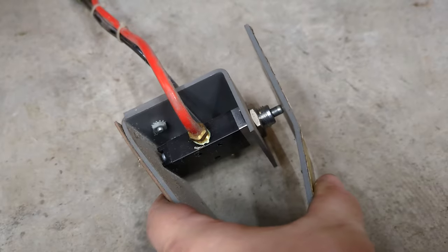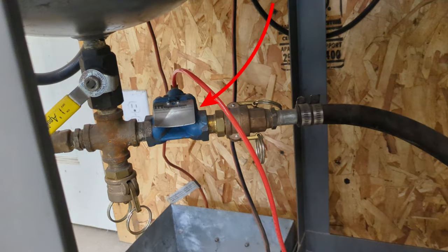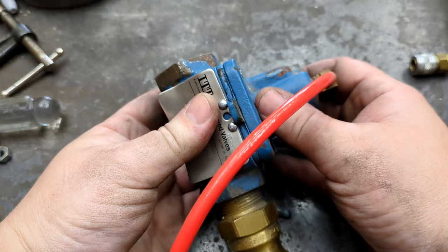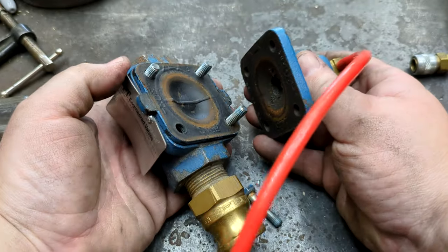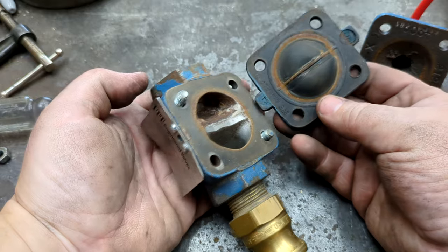Here's what I found: the foot treadle opens a pneumatic valve, which releases pressure on a line, letting another pneumatic valve on the main line open, placed just after the media hopper. My suspicion was focused on that main valve — why is it right after the media injection port? Wouldn't that lead to media jamming up the valve's action over time? That had always seemed weird to me, but I've learned enough humility to admit that sometimes things that look weird actually have a good reason. So I opened it up. Turns out it was a diaphragm valve. Diaphragm valves can handle a wide array of nasty, chunky, corrosive fluids — one of their main uses is in sewage systems. The diaphragm means the working fluid never even comes in contact with the delicate valve mechanisms, making them very resilient.